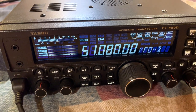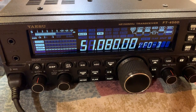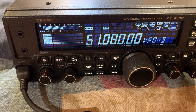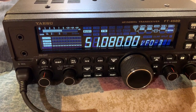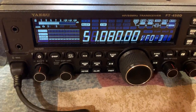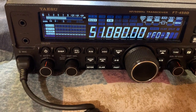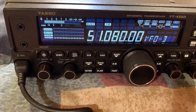I hope you all enjoyed my YouTube review of this Yaesu FT-450D — it's an HF and 50 megahertz transceiver, so it covers 160 meters down to 6 meters. I also have a Yaesu 2900R VHF radio covering 144.000 to 148.000 MHz, so I really don't need VHF in this transceiver as well.